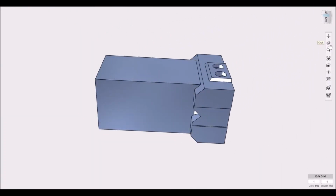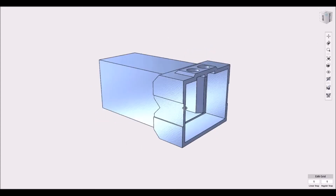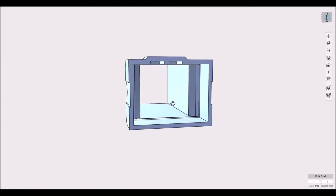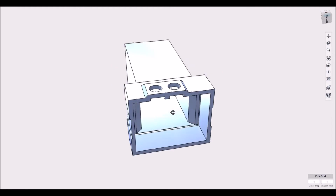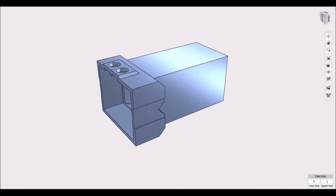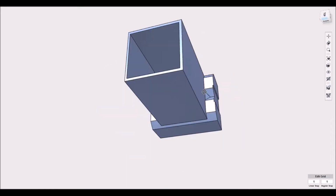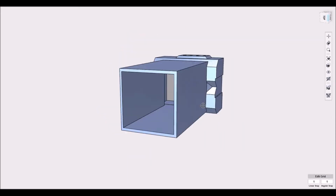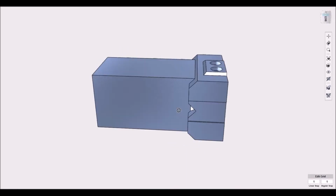Next up is a shroud for a passive infrared sensor that includes access holes to allow adjustment of the sensor's duration and sensitivity. The long shroud narrows down the field of view of the sensor because we want it to detect when the cat crosses a specific line. There's a second sensor nearby in parallel that allows us to determine direction by which line gets crossed first.